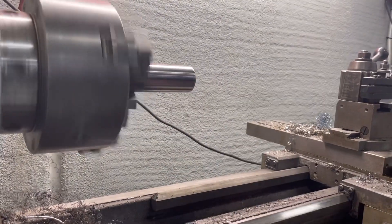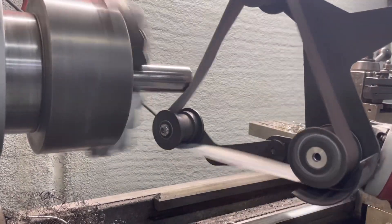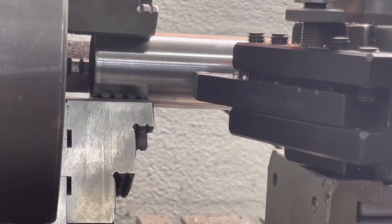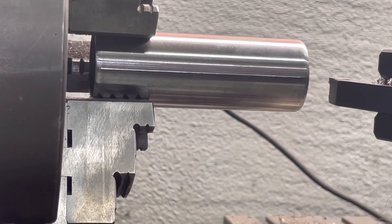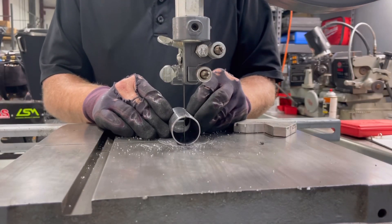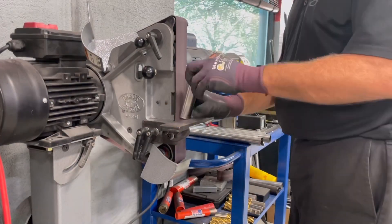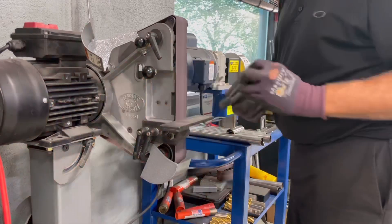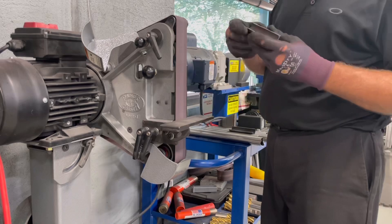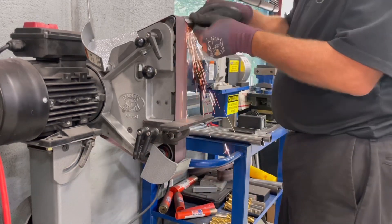This is how I polish my tubing on the lathe, generally with my little belt sander attachment on a 90-degree angle grinder. This is the piece and what I'm going to do is split it. I've marked it with the lathe cutting tool so I can set it up in my bandsaw and slice this thing in half without taking my fingers off. Then I take them over to my old belt sander, true them up real nice, put some radiuses on them, and then we're going to put those on the fixture table so we can weld to them.